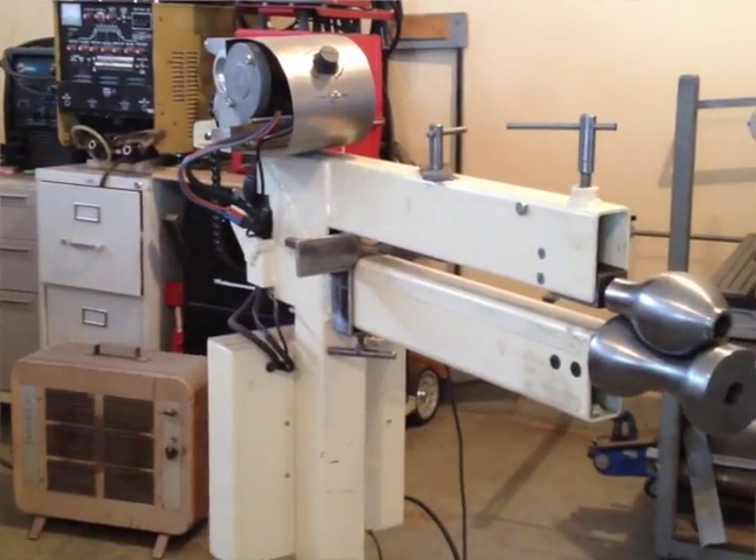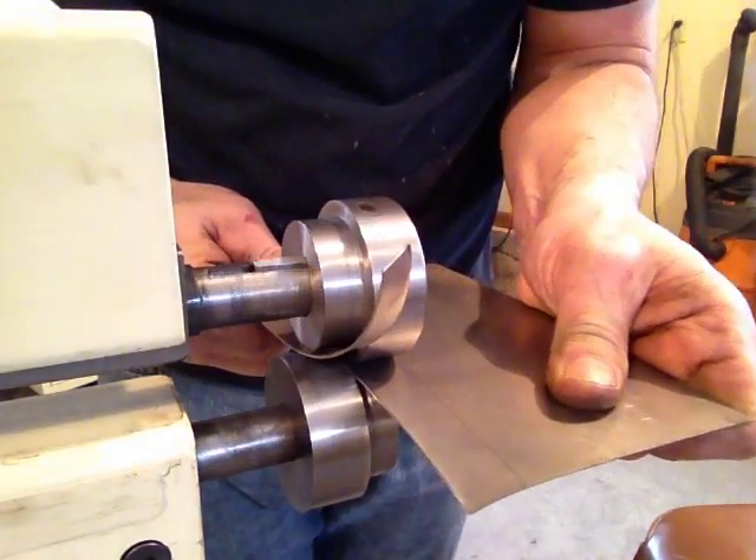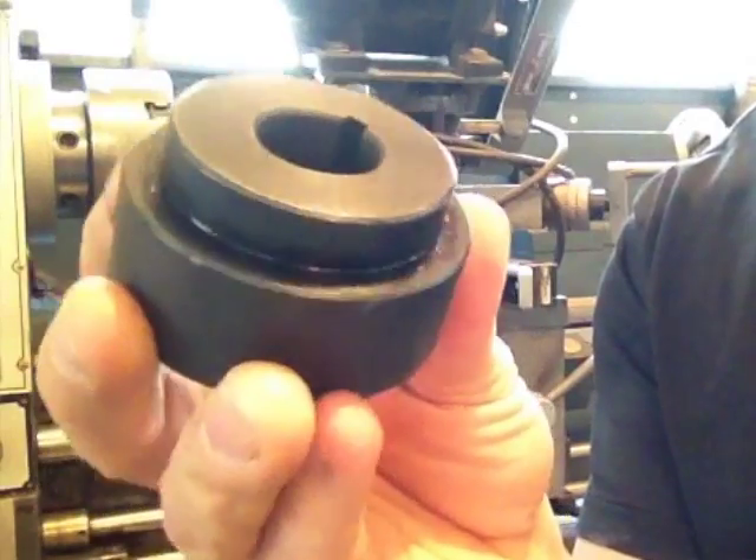What I'm going to do is incorporate my bead roller. I'm going to take these hubs — these hubs are used for gears and pulleys. You get them at the farm supply place. My local place is called Big R. Fantastic place. I've seen them all over the West Coast. If you have one near you, well worth going to for that bigger, harder stuff to find. I use these on my bead roller because I can put them on my lathe and cut a profile without having to go to big stock and drill out. It's a big time save.